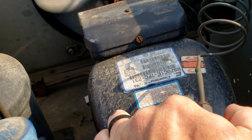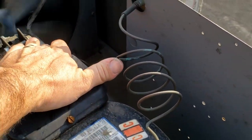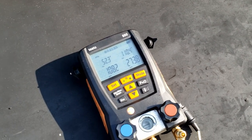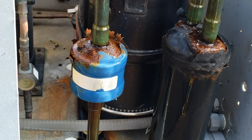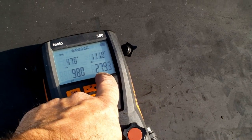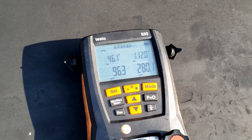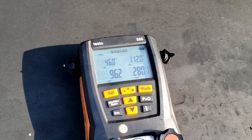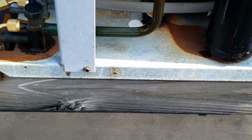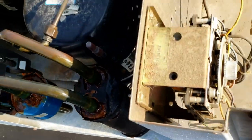There's a little rattling out of that compressor — I don't think that's liquid slugging. I thought maybe it was the evaporator or the condenser fan, but even when we stop adding refrigerant it doesn't really get much quieter. That compressor's getting ready to go out next. That is a 2000 compressor and the head pressure's higher than it should be too. Looks like it's probably pretty dirty. Let's put this into a pump-down before we waste too much time. We're getting close at two and a half pounds — I'm kind of curious if we've lost valves because that doesn't sound real good.